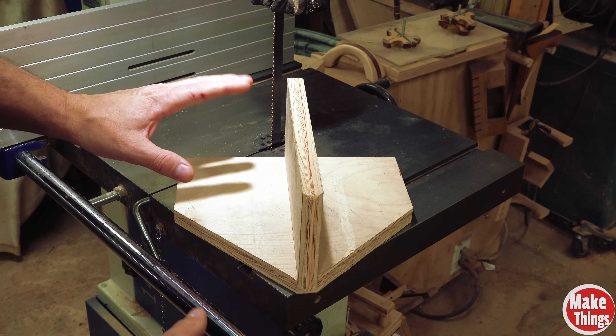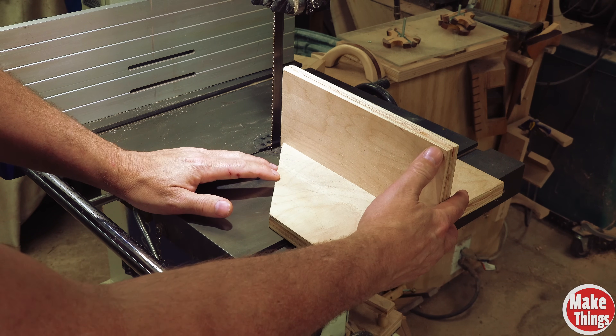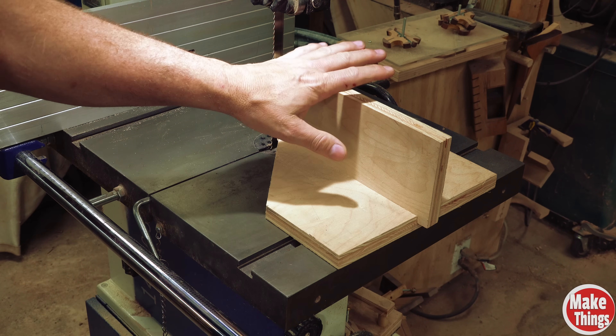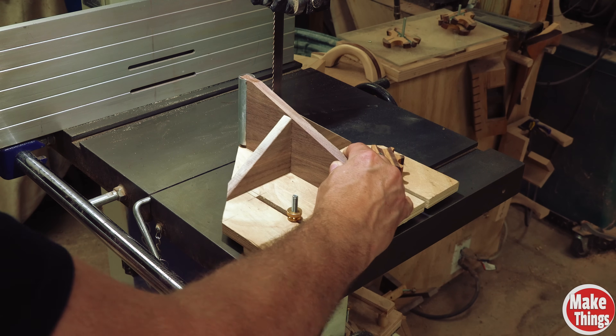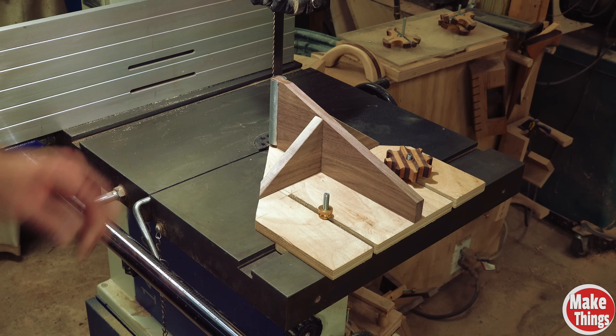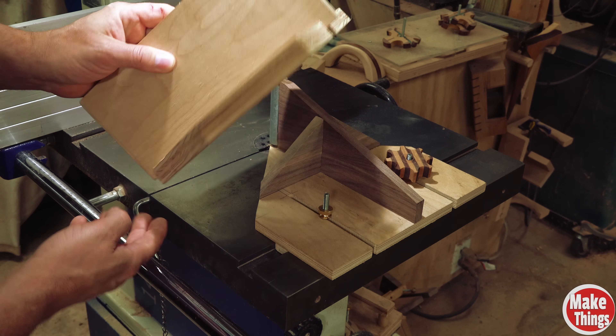The next method, which really is a very good method, is to create a single point stop that sits next to the blade. A single point bandsaw sled is all in the name — you've got this front edge here, you keep the distance that you're looking to cut away from the blade, and then you lock it down with clamps. Because I really don't like using clamps, I made my own that uses the expansion bar in the slot, and I can lock it wherever I want. It's also got a metal tip on it, so it really stops a lot of the friction problems that the wooden ones have.